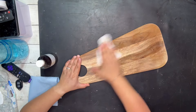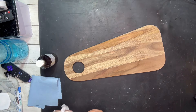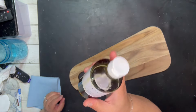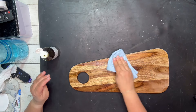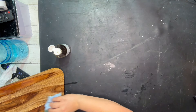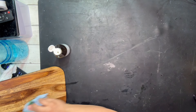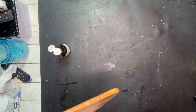After sanding I went ahead and just used a baby wipe to wipe off all that extra dust, and my heat gun to dry it off again. Then I'm going to go in with my Fusion's hemp oil — it is food safe — so I'm going to give it one nice healthy coat and let it soak in really well. That's basically all it took. If you do have boards like these at home, you do want every now and then to do this and give them a drink to make sure they stay conditioned so they last a lot longer. I just love the beautiful colors of this piece — the natural tones were well worth it instead of that darker tone.